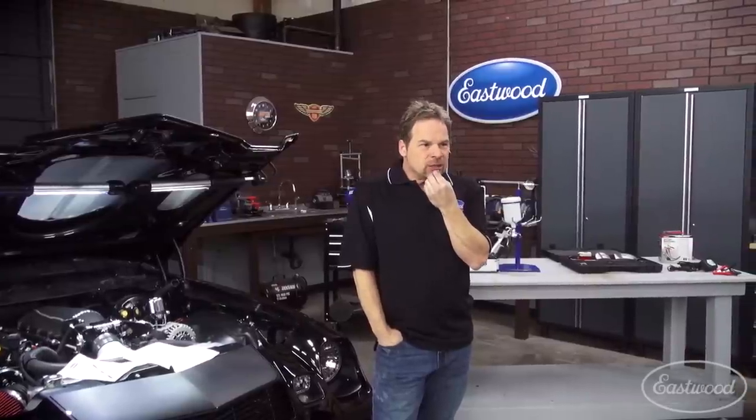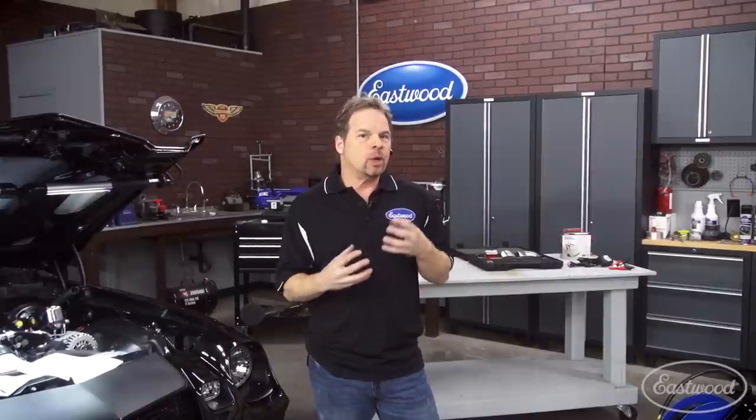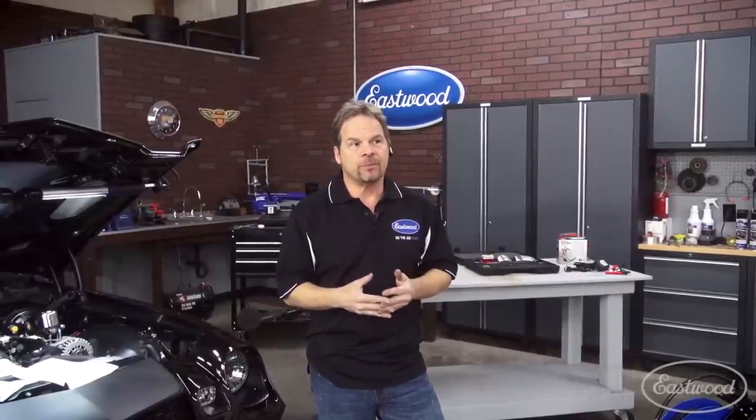Which welder would I use for an all-round restoration? What's the most versatile welder that I could reach for? If you're going to weld chassis or you're going to do really heavy-duty stuff, if you've got to build a trailer, or if you're going to do like a mezzanine in your shop, the 250, great machine. You can also dial down and do very fine. It'll take a .024 MIG wire as well. So you can do very detailed work with the MIG 250.